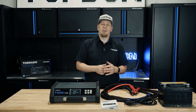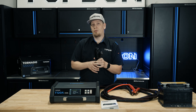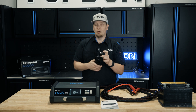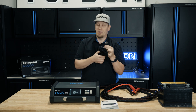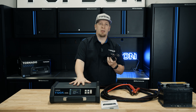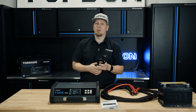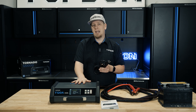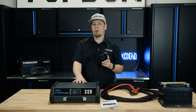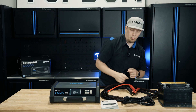We're going to show you just a little bit of the hardware here. The unit comes with two cords for plugging into the wall. For the U.S. region you have a 20-amp circuit, 110–120 volt. This is designed for when you're going to run higher currents to the T120A — above 80 amps you should use this plug and make sure your breaker is a 20-amp, or you may pop the breaker. Make sure to select the correct cord appropriately.